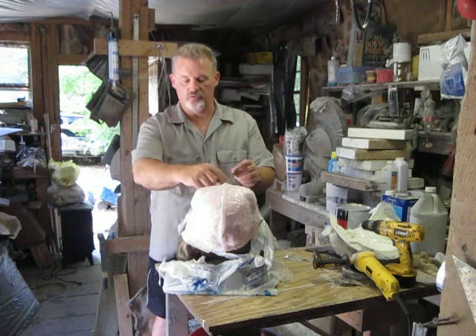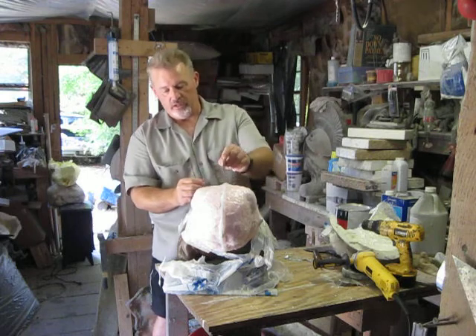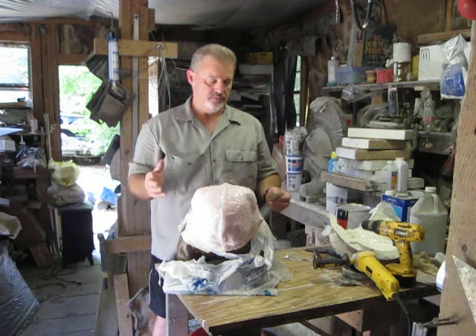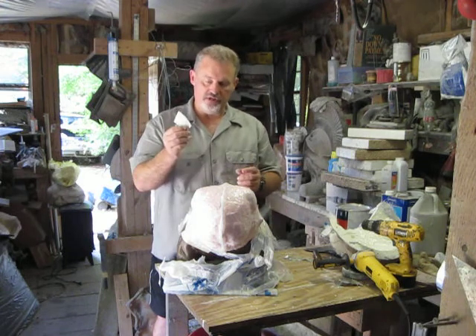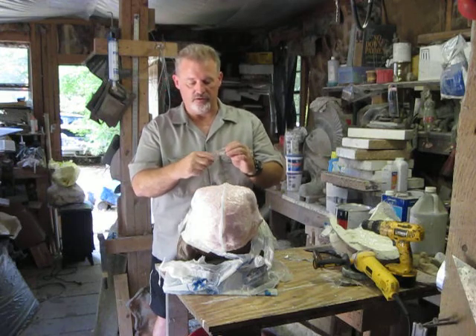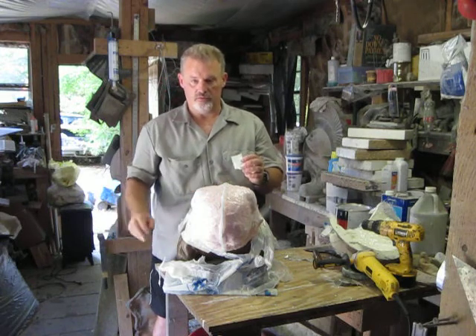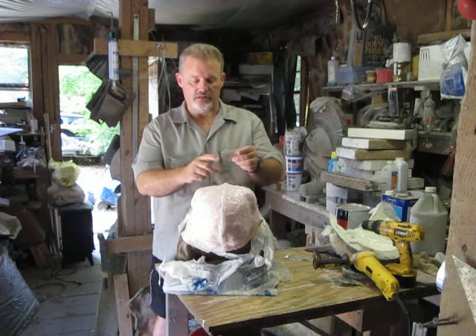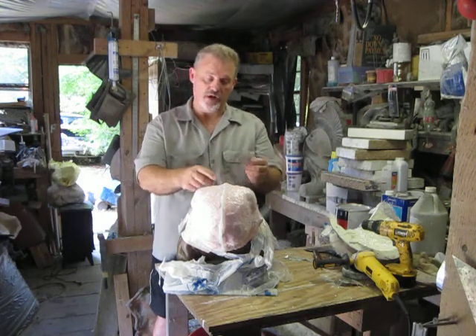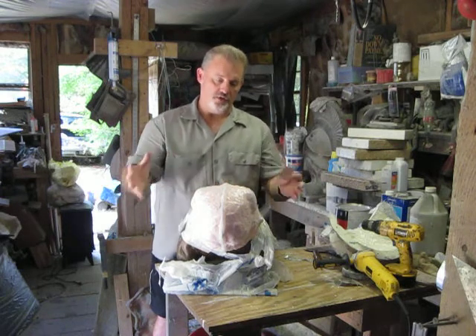It was cut close to the profile and I placed them in, using aluminum tape to adhere the pieces. Before I stick the leading edge into this, I put a naphtha and vaseline mixture on both sides so it will not adhere to this on the de-mold.